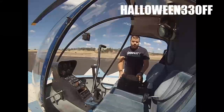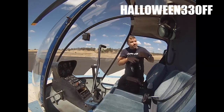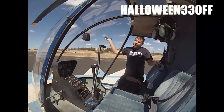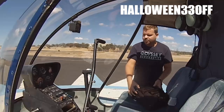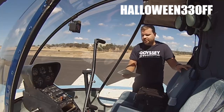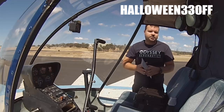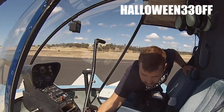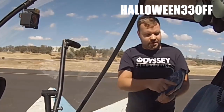Next, go ahead and hang up your headset. If the helicopter has a tie-down on the rotor blade, now is a good time to take that off — push up on the blade to level it. Most schools will have some sort of pre-flight checklist, typically right in front of the seat. This checklist is often a condensed version of the pre-flight checklist found in the R22 POH.